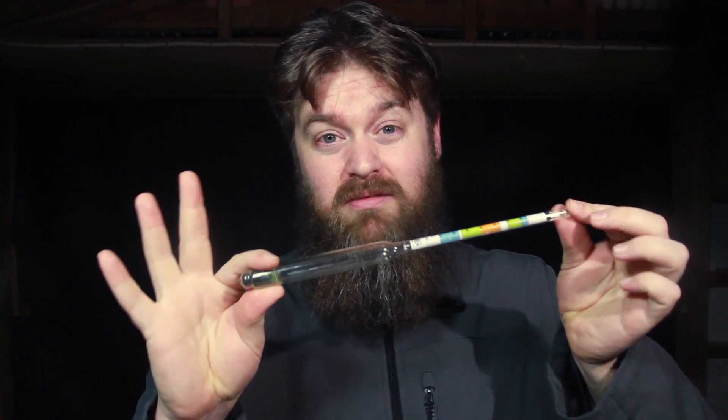If you're just wanting to test the waters with hydrometers, I'd suggest getting a relatively cheap brewer's hydrometer. These give you three different scales: specific gravity, Brix, and alcohol potential. They also give you a pretty big range of gravity in one instrument, which is nice if you just want to try it out. This specific one runs from 0.99 to 1.16, which covers most things. The downside is that the entire range is crammed into a small space, meaning every increment is very small — if you've got bad eyes or want to be super accurate, you may not find that satisfactory.